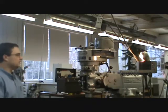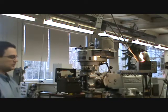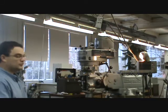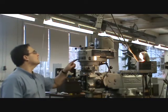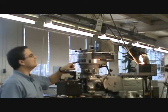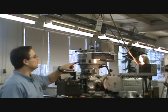Here's an example: if we were cutting mild steel with a 1-inch high-speed steel cutter, we use the equation RPM = 4 × cutting speed ÷ diameter. For steel, cutting speed is around 90 feet per minute. So 4 × 90 = 360, divided by 1 inch = 360 RPM. Go to the chart and find the closest value without going over — that's 325 RPM, which is in low gear, the top row, at the fastest speed in low gear.